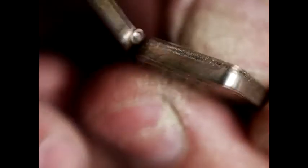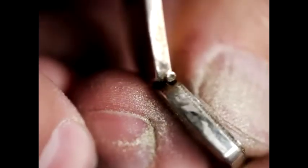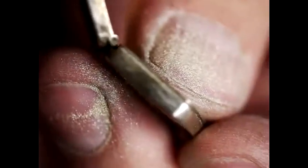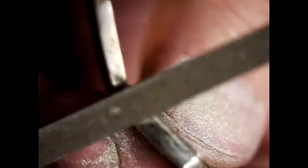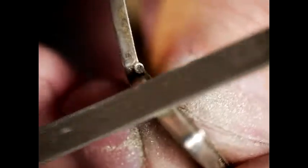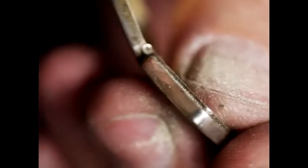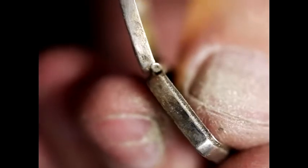File until you get a nice smooth result, then take a little bit of emery cloth across and make sure it's really smooth. You can also use a slightly finer grade file and carefully go over it, just to make sure it's all nice and smooth before you put the new bale on, because the metal needs to be bright for the solder to take properly.